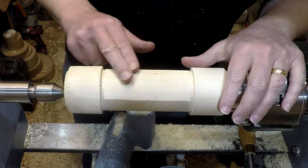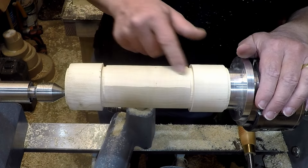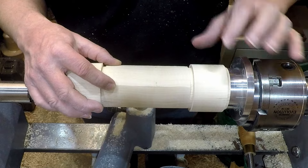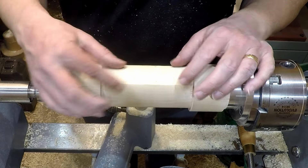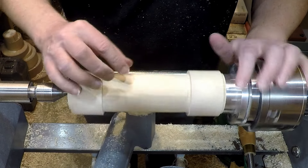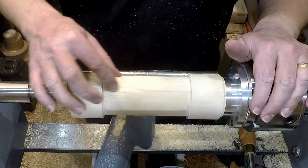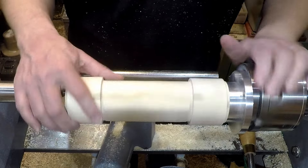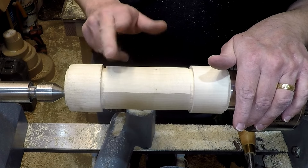This is now turned down and I've got a few tool marks in there which hopefully will sand out. I've gone down to the depths of the depth guide. The first side is much wider because it went on three steps on the index ring — it's wider because I've not rotated around to take another chunk out of it. The two sides either side of it are slightly smaller, and because that is a proper cut of two stops on one side but three on the other, those two are smaller again. So we go from large to slightly smaller to a lot smaller — it's a really different type of effect. I'll get this one sanded up and come back when I've finished.